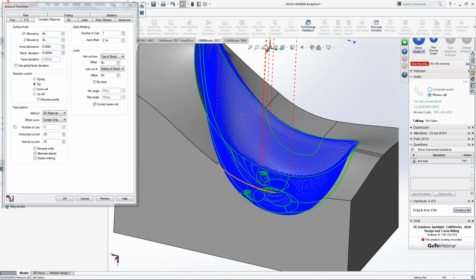A 3/8 ball end mill with a long shank on it that's really stable. Maybe you have one with an insert, has a taper going up on it, and it's really detailed down inside there. But we cannot get the fillets that came out of engineering that's already signed off through approval, right? So now we need to build an electrode for it to come down and actually cut this part. So we'll get it all roughed in, we'll take it over to the sinker, we'll put the electrode in, and then we'll start cutting this information down inside here with the sinker.